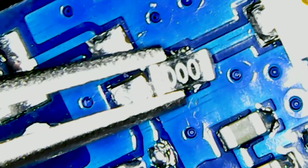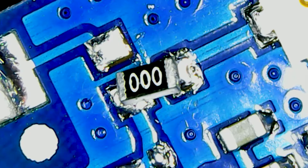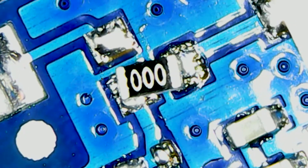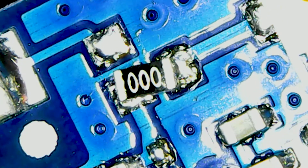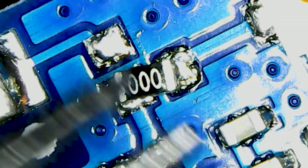Let's go ahead and place that. We more or less have it in the right place, so if I can gently blow hot air here we should be able to allow this to just melt back into where it needs to go. As you can see, we're melting the solder and really giving it to these components, and now if we haven't burned the board this should be enough to allow us to use it. This is not the most beautiful job, but I'm going to let this dry a little bit and then test it. A good indication is if I'm able to move this with tweezers, then we will need to redo this. So blow on it and then attempt to move this — if it's soldered in place then we should be good, if I didn't fry this board.